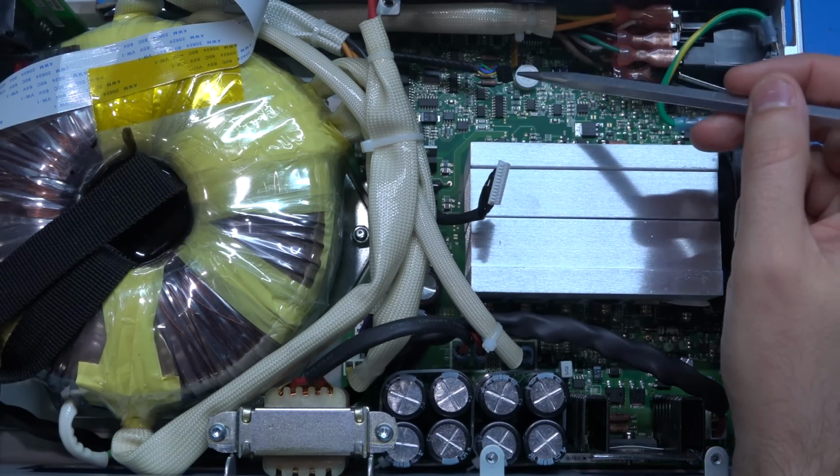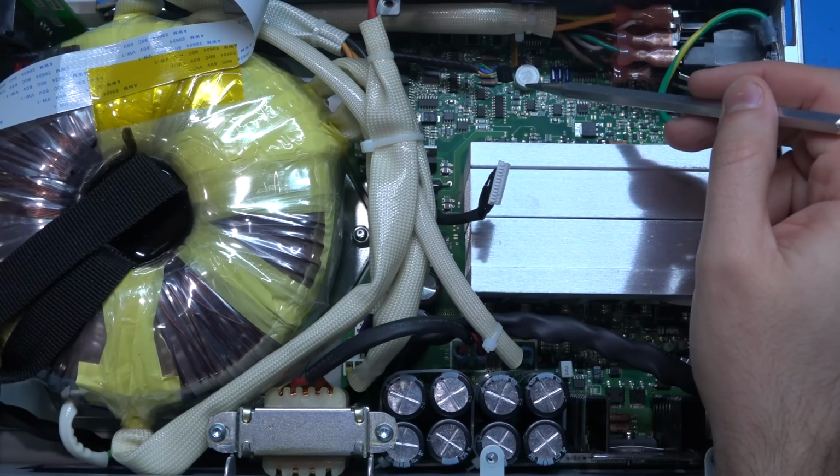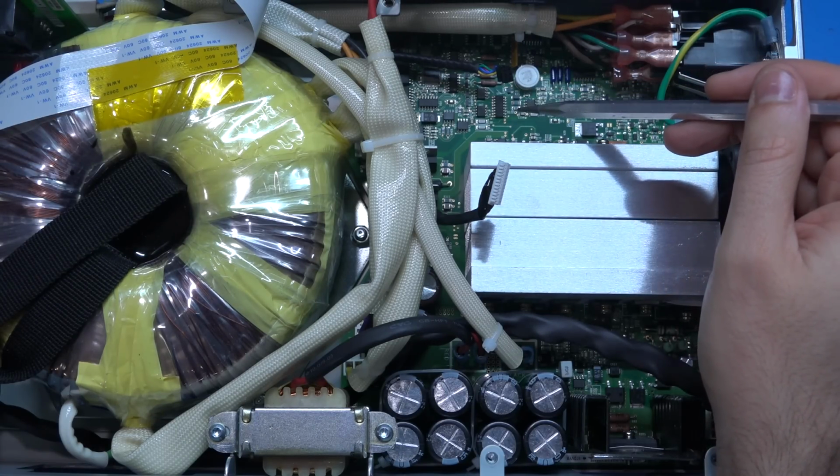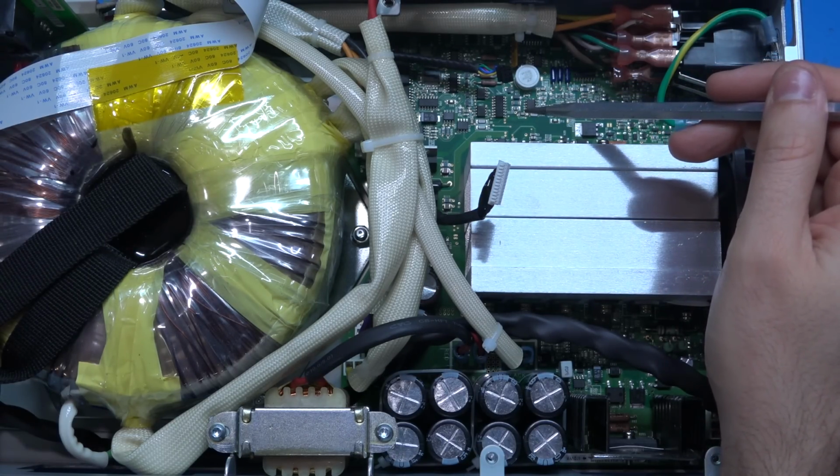And it's not very often that you find a precision reference inside a power supply. This is an LM399, I believe, which is binned. It has a different part number, but I think that's what's inside of this. And you need this because this, of course, has a 6.5-digit digitizer multimeter built into it.